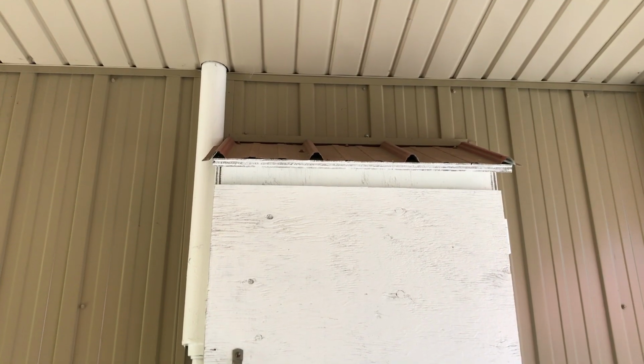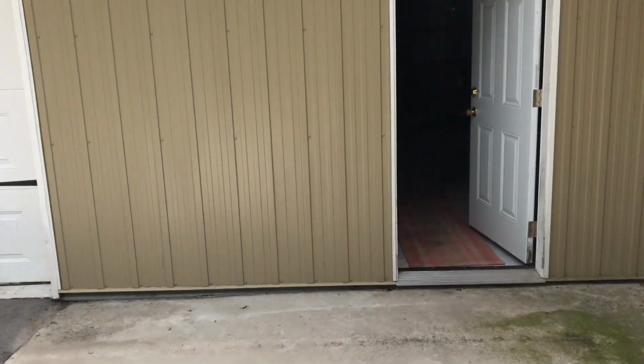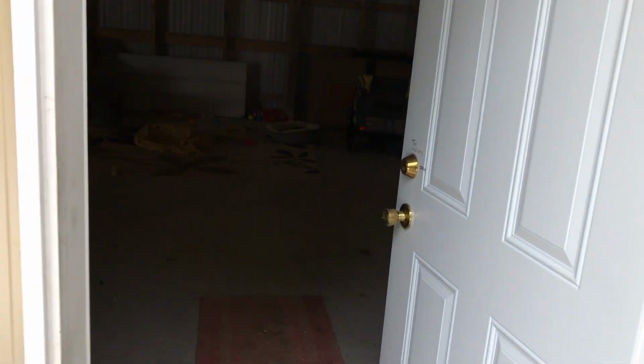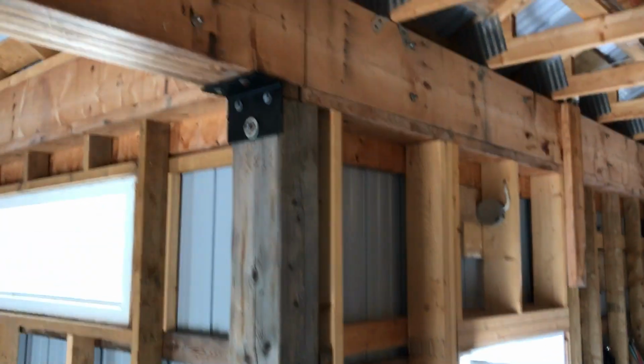And when the Romex crosses from there to there, I have to protect it with a conduit of sorts. Still working on that. I'm gonna talk to the inspector. I'll just run like a piece of 2-inch PVC conduit just for that section there.